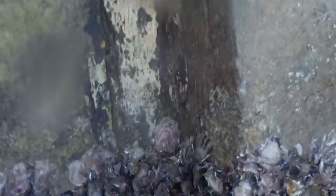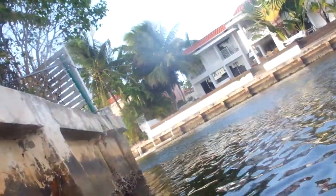Some preventative work could be very advisable. You can see horizontal cracks on the panel — hairlines that repeat themselves everywhere. This repair was basically somebody who just slapped some concrete on it, same thing with the radiuses. Nothing was done on the bottom section of the seawall, so all the erosion happens on the bottom corner of the pilings. The cap is damaged — this last section is about 20 feet long, and right here the cap is separated. The repair attempt was just to fill it in, and it's not really structural.